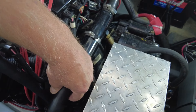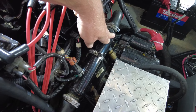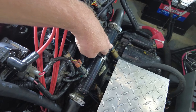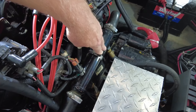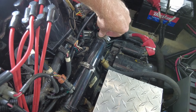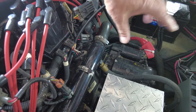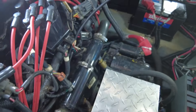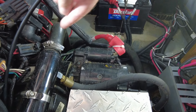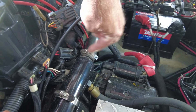A funny story — a number of years ago when we had our 400 Sedan Bridge, during the first full summer after buying it, we were driving across the lake when my partner heard a different sound from one of the engines. I investigated after seeing the engine temperature rising, shut that engine off, and came down to discover one of these cooling hoses had blown off — probably because the previous owner hadn't tightened the clamps during winterizing. Many gallons of water were flooding into the engine room, but we were okay. The engine overheated simply because cooling water was bypassing into the bilge. Easy fix — just put the hose back on, clamped it, dried it up, and we were good to go.